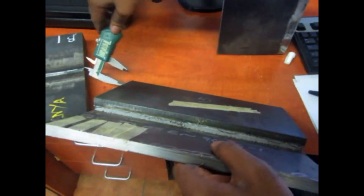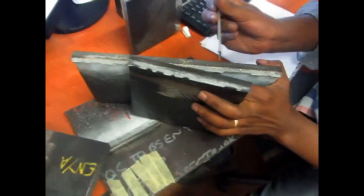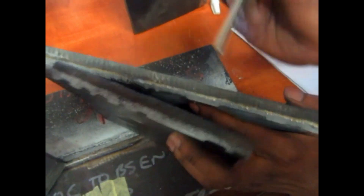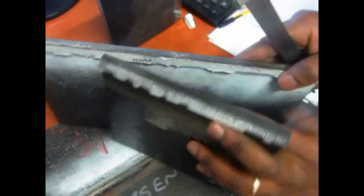This is passing. But in this other case, the tip of my vernier caliper is hitting the parent metal — it's flush on this side but it's hitting the parent metal rather than the weld. So this one here is passing, and that one here is failing.